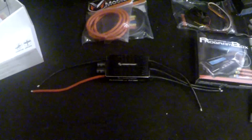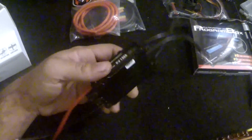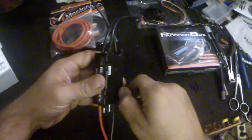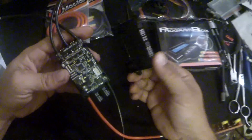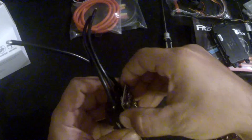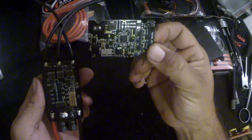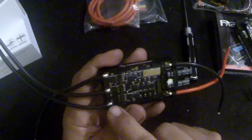Let me go ahead and take this to the workbench. Actually, since I'm right here with the camera anyway, I've got a feeling this is going to be a cake thing to open, so I'm going to just go ahead and remove these four screws. There we go — easy peasy. The bottom case comes right off. It looks like there are some easy jumper connections here, and I can just pull this daughter board off. Simple! This is such an awesome design and it's well put together too. Be careful with static electricity, but that is an awesome design — makes it very easy to get in here. I'm just going to swap these wires right out, no problem.